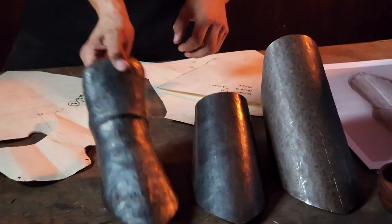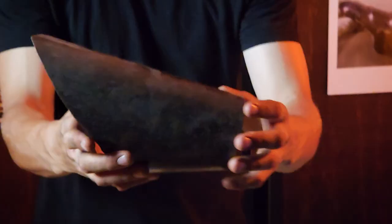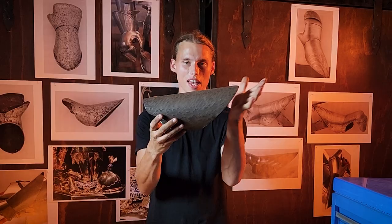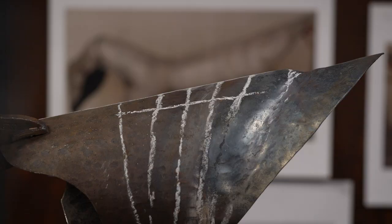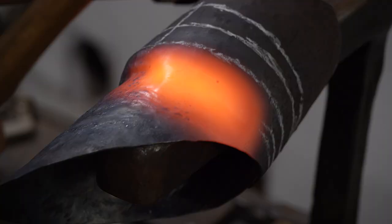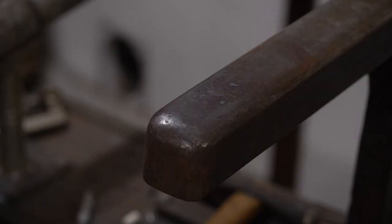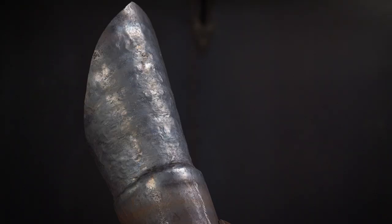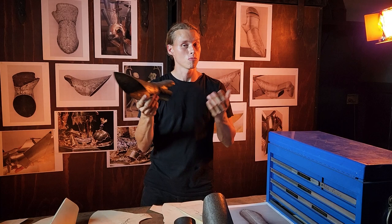The second method is more of a sculpting approach. An example is the Manafer piece in a pair of Italian gauntlets, where the left hand is made out of one piece — the hand and the cuff are all connected. We start out with a piece kind of like this, basically a cone of steel with some taper and cutouts at the front. The armorer then uses their mind, looking at the original source, and uses heat and hammer to raise that shape. You're thinking like a sculptor, like a stone mason, like a clay sculptor — looking at the original source and putting that shape into the steel. You reference the proportions and angles to get your depth, constantly going between the anvil and the torch and comparing your work to the original back and forth.